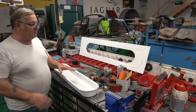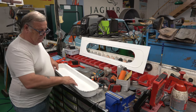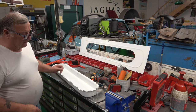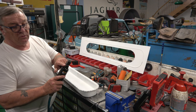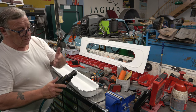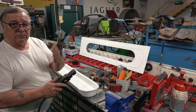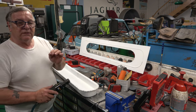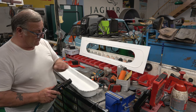I'm working on this back piece for the Citroen — it's going to be underneath the back tailgate. What I've done is made this piece, and now I'm putting holes all the way around so I can plug weld it all the way around. I've got one of these tools which does two jobs: it's got a hole puncher and a joggler. The joggler offsets the metal so when you put two 1mm sheets together you end up with a flat surface. The problem is the holes are 5mm, so you've got to be really precise when you put the plug weld in to catch it right in the middle.